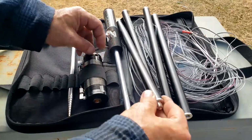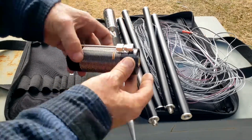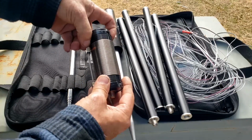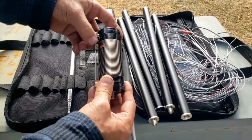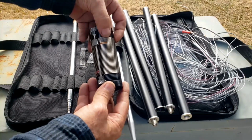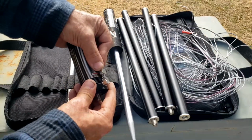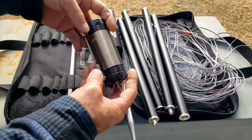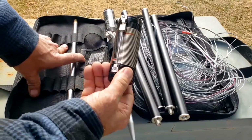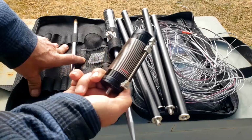On the top of the tubes, we have a cool device. Check this thing out. They have it marked for, what was it? 40 meter and 20 meter. That one there, I believe, was for 14 megahertz maybe? I'll have to look in the book. But they have a couple of them marked for reference. But you slide that up and down, and all the way at the 10 meter band, you don't use this. This part gets left out for 29 megahertz.